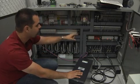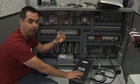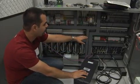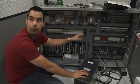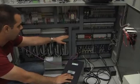When the sensor is covered, it tells the robot, hey, you're all the way over on your x-axis, or your center, what we call home on the x-axis. And what we do with these limit switches, that'll actually cut power to the motor if they're activated, if we cross over them. So that's a safety design there.